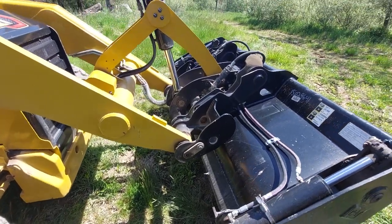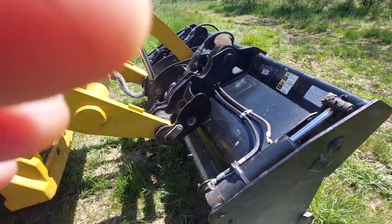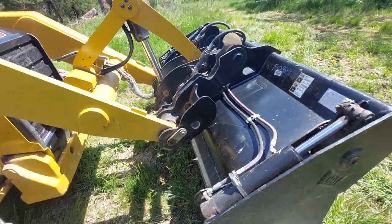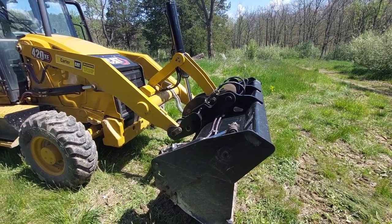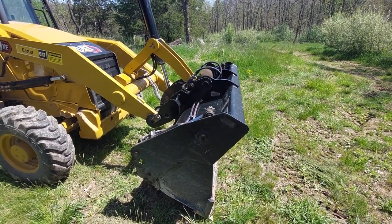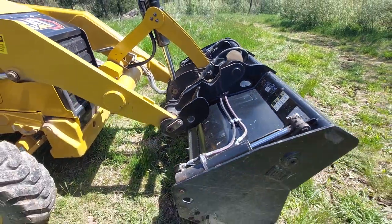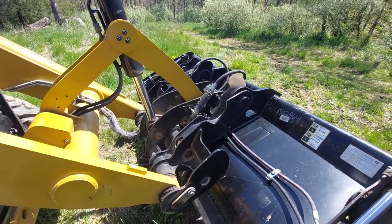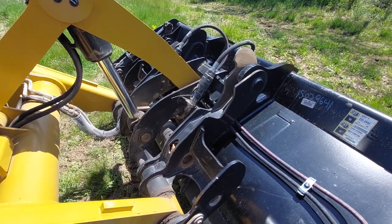Now let's move to the front coupler. They used to call this the IT coupler; now I think they just call it the XE model, and it comes standard. You've got all your different attachments, but the one negative is that the coupler shoves your bucket about 8 to 12 inches further out away from your loader frame and machine. For me, what that changed was grading and backfilling — you just don't have the same reaction time. I like the bucket closer to the machine. The Case just had pins that slid in and out right on the main boss, keeping the bucket the same distance. I liked that better, but CAT's got a lot of attachments going on these days, so I understand the reason for it.